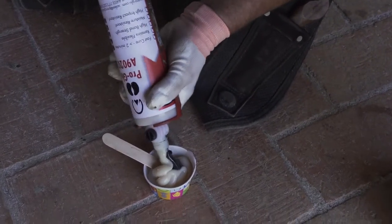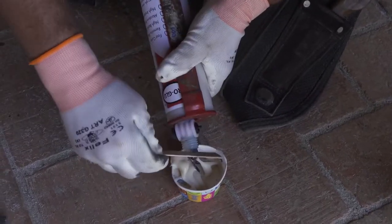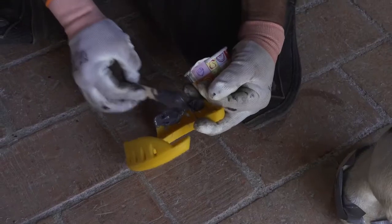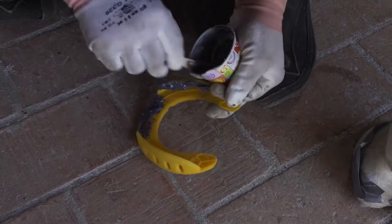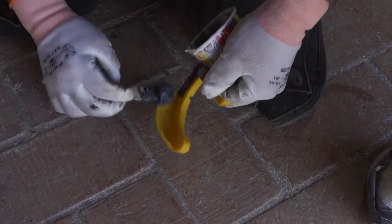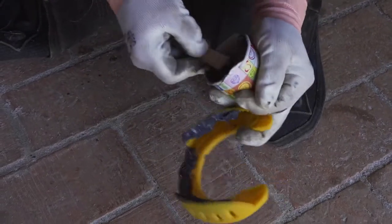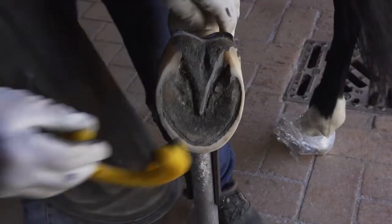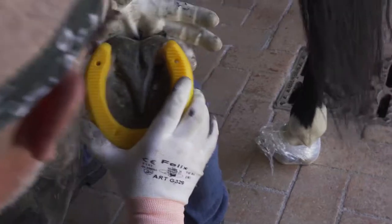In this case, I don't like to use the mixing tips. Since the proportions in methacrylates of the base material relative to the hardener are not 1-to-1 usually, they're 1-to-4 or 1-to-10, I prefer to throw it out of the cartridge immediately, directly into a little ice cream cup. The ice cream cups are ideal because they're smooth on the inside and they're low. With a wooden tongue depressor, which I've cut off square at the end, I mix it and can make sure that there is the right proportion of hardener in the base material. So I mix it up by hand thoroughly,